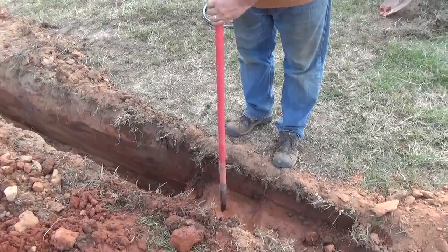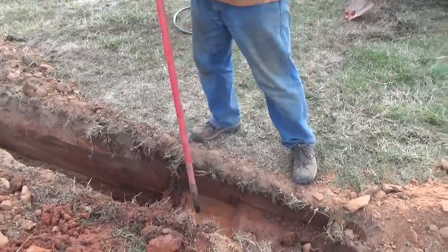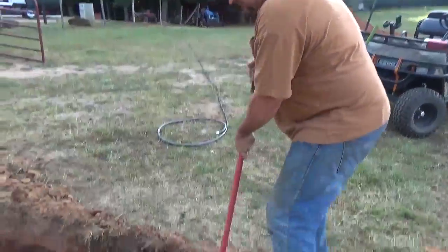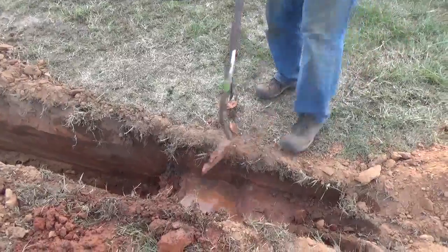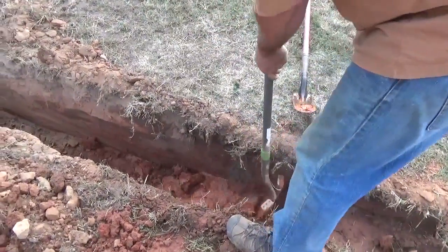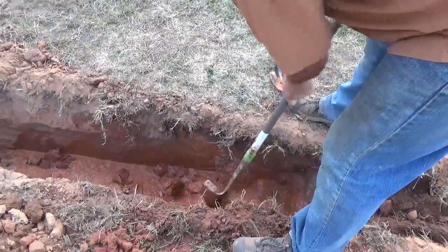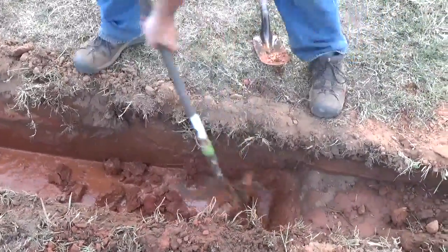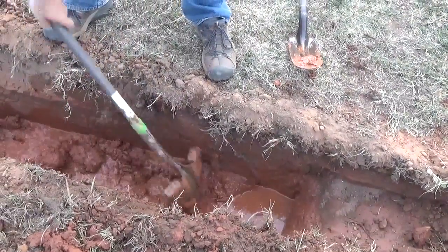I've had this thing for six years or longer — it's cracked but it's the absolute best trenching shovel. I started probing and I'm hitting something very hard right there, and I think it's my water line — that's where the X marks the spot from dowsing. So instead of just trenching through and busting it, since this ground is like concrete right now, I'm going to use a bigger shovel. Water helps tremendously — I'm going to break that dam out. I'm already deep enough, thankfully, but I could have caught it with a tooth and that would have ruined my day.